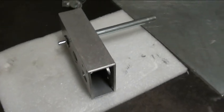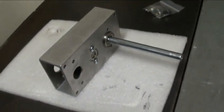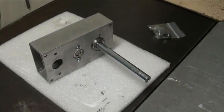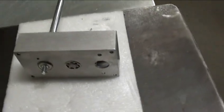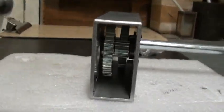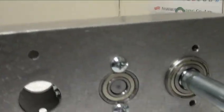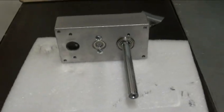Instead of fast, high-strung motors, I'm looking at slower outrunner motors — larger physically, hopefully a little less speed. I'm looking for a gearbox, so I'm giving these a try. This is made by Andymark, for US FIRST Robotics competitions. It's a 12.75-to-1 reduction gearbox. The casing is aluminum extrusion. The gears inside, I believe, are 24 pitch — I could be mistaken — but they're all 41-30 or 41-40. Everything runs on ball bearings. The shaft is a nice half-inch with a full-length keyway.